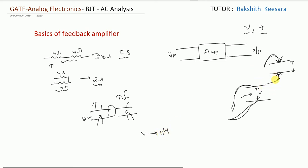Next, you want to sense the current now. See, these are two wires. If you want to sense the current flowing through these wires, you need to keep your current sensor here. You cannot sense the current between these two lines. In these two lines, voltage will be there. From each line, current will be there. So if you want to sense the current, you need to keep your current sensor here or here, your wish, in any line. Indirectly, what I am telling is, for sensing current, we are applying an element in series.